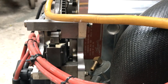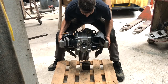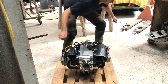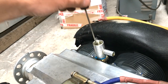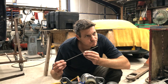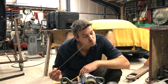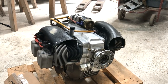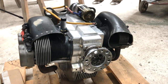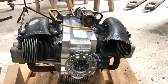The fully assembled J2200 engine, ready to run, weighs 61kg — not too bad for a four-stroke, and I can lift it without any trouble. The engine has a wonderful service history and is recorded to have done 393 hours from new. Of course, the best way to assess the internal condition of an engine is to taste the oil. What you want is a nice rich flavour — nothing too tangy or bitter, quite succulent with no significant aftertaste. I expect I will use this engine for the WIG boat because I like that it's a four-stroke, air-cooled, and only around 10kg heavier than the Rotax but has another 15hp. No coolant to worry about, no gearbox to maintain, and no mixing of two-stroke fuel. The pros, I think, outweigh the cons.